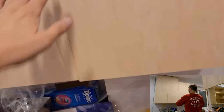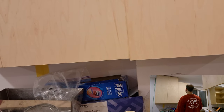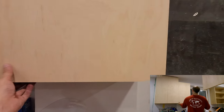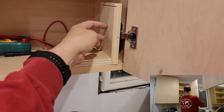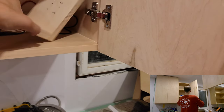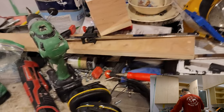Okay, so I guess when I built the cabinet, I didn't get it quite straight. It's not rectangular, it's a rhomboid or whatever. So there's some work to be done there. Possibly more important is I finished the jig, which will allow me to just slap this piece of wood up against it, and then I can drill. So down here at the bottom, I drill these two, and at the top, when I flip it, I drill those two.